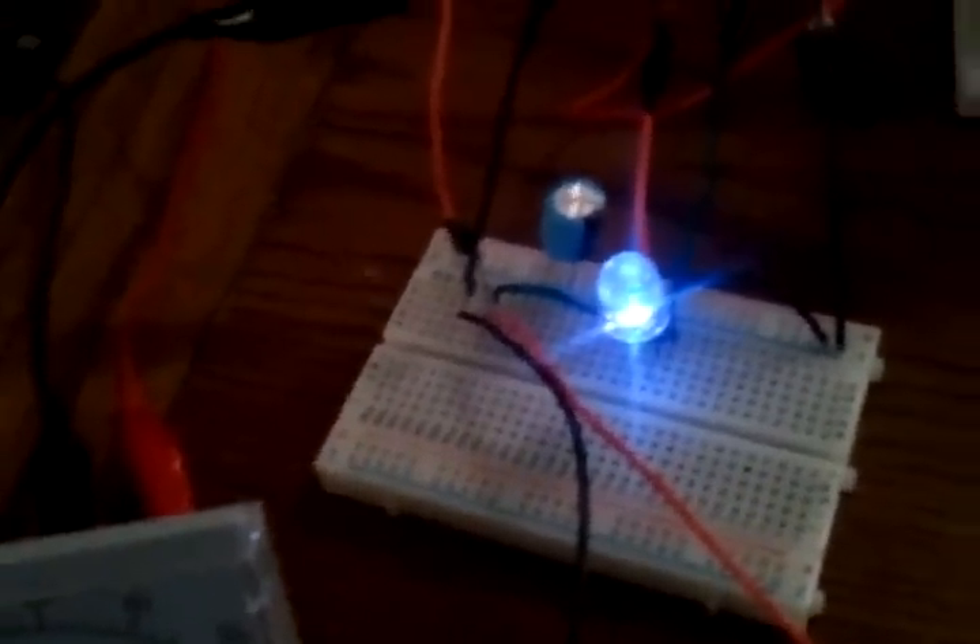This is a circuit that Lidmotor showed us how to make. There's the LED — I'm looking straight down on it and you can tell it's pretty bright. It's running around 15, 16, 17 milliamps, something like that. On the Lidmotor circuit I put a 50k pot so that I could get better current through there. I'm going to short circuit this cell, and notice that my milliamps jump past a hundred.